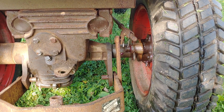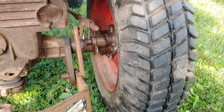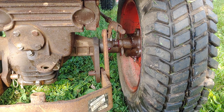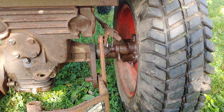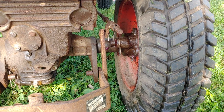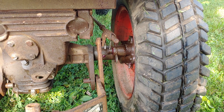Then I kept trying to put grease in that fitting, and eventually it finally went in. But I really had to use all my force, almost leaning on the handle of the grease gun to push grease into that. When I removed it, it was under so much pressure that grease actually came out of it. But then after that, I hit it a couple times and it completely freed up fine.